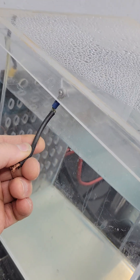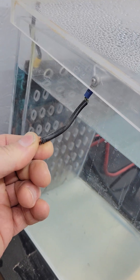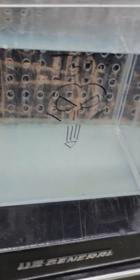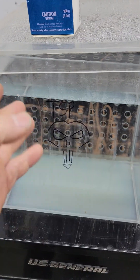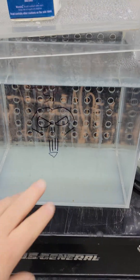We have a copper plate separated by a little shield just to prevent accidents. Then we have a stainless steel rod run through the inside, usually just connect with an alligator clip or some wire nuts, and then the ground side goes on that. Basically, we run that through and that gives us color — so if we're looking for anything in the whole color spectrum when it comes to titanium anodizing, that's how we get it.